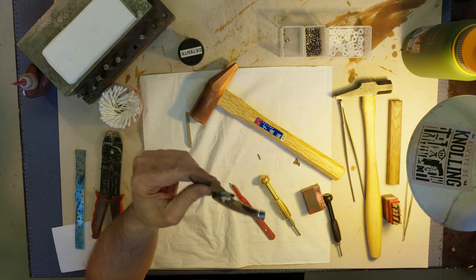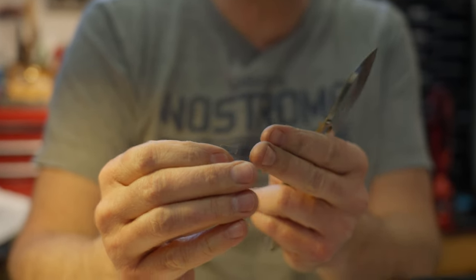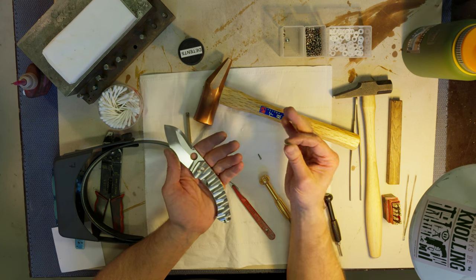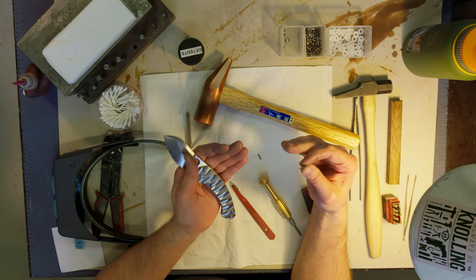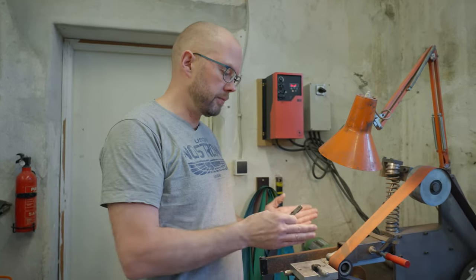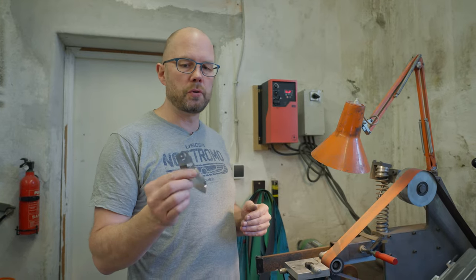I have a number of these lock inserts in slight length variations. Even though I shoot above my desired goal by a few thousandths — or in metric, a couple hundredths of a millimeter — that decides if it's a good lock or not. So precision to a certain point, and then I have a means to adjust afterwards. Now I'm just taking off a hair each time, walking back and forth, grinding just a little bit off, reassembling, and just sneaking my way into the proper fit.